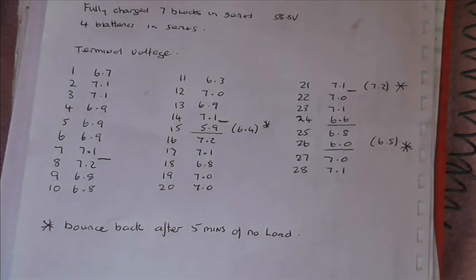It seems like the lithium iron phosphate is doing most of the work right now in the middle of summer — fair enough. I'm not over-discharging them, which is important to keep the cycle count down. What do you think — should this just act as a buffer, or should I disconnect the blocks showing the lowest voltages? Each block has a bolt either end and a bus bar, so I can take individual ones out of circuit and only use the ones showing the highest voltages for better stability. Let me know what you think.